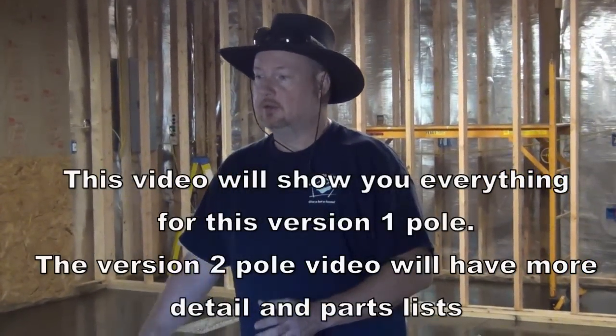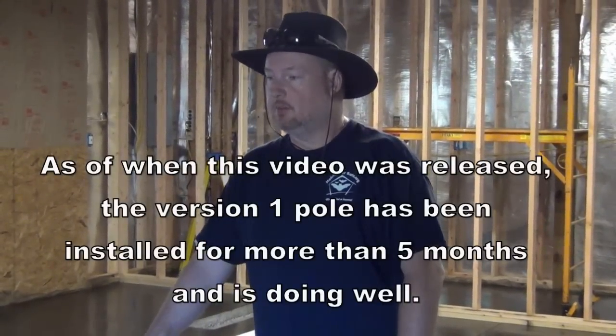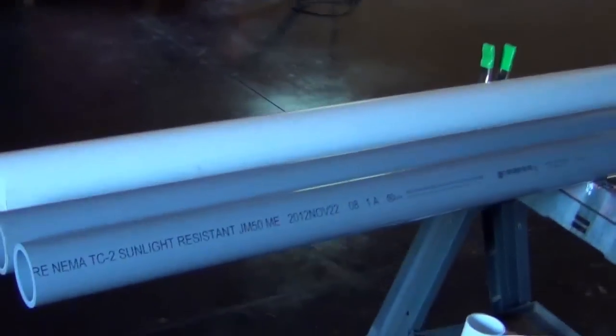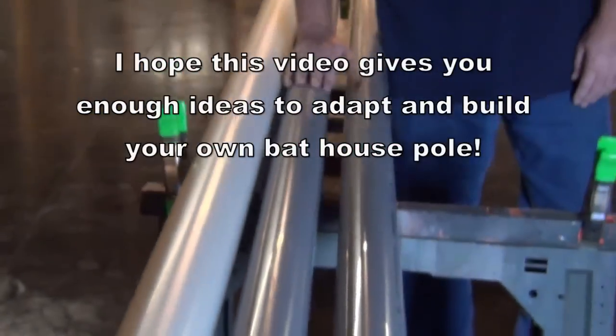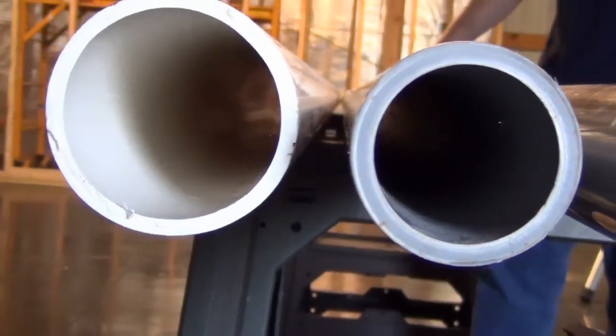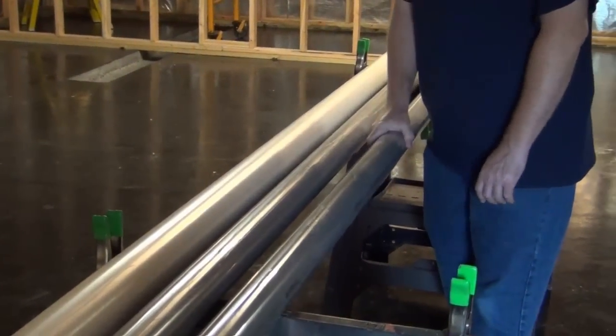The problem with PVC is flexibility. With standard plumbing PVC, when you get to the smaller pipes and over time in the sun, we're just going to have to see how it reacts. The base pipe is three-inch schedule 40 PVC — drain pipe. Over in the electrical section you can find two-and-a-half inch schedule 80, and it's important that you get schedule 80. You can see the walls are much thicker, and schedule 80 pipe is much stiffer — this two-and-a-half inch actually has more stiffness than the three-inch.